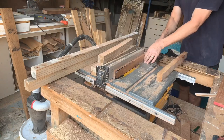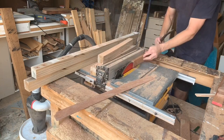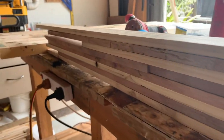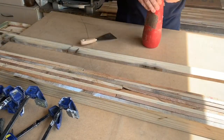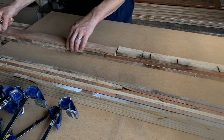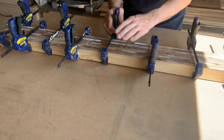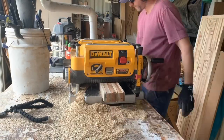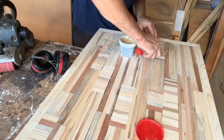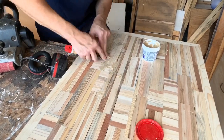What I'm doing now is re-sawing the timber — not ripping it. I actually got the good oil from James over at Fix It Fingers, he's got an awesome channel with about 50 videos and he pointed out just a bit of terminology. I'm a learner — much appreciated, feel free to go check him out. As well as using up all this bowed and warped timber, I wanted to show you don't need a jointer or a thicknesser to achieve this effect — if it's cut thin enough it's going to have a bit of give once you clamp it all together and you're never going to know. That said, I've got a thicknesser which I'm very grateful for, but you could easily clean this up with a belt sander or a hand plane.